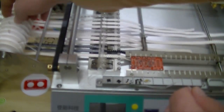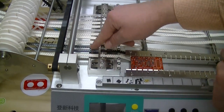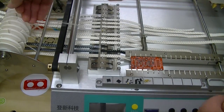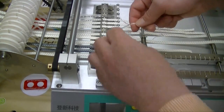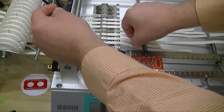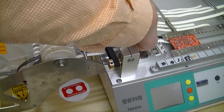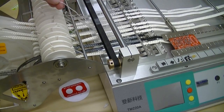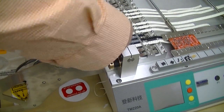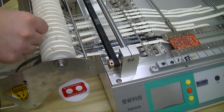Pull the cover back up and put it around these spools, which pull it up and keep the parts exposed as the machine feeds. The problem with that, especially if you're using small strips of expensive components like these 3.3 volt regulators or buttons, is that you don't necessarily want to waste enough tape to get it all the way back and mount it in there. So what I've taken to doing is tying a little bit of dental floss to the end of the tape. I'll feed it up until the parts are exposed, bring the tape back under the drive belt and under this bar.